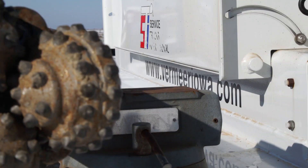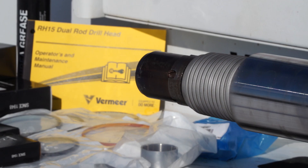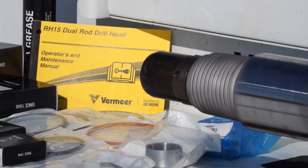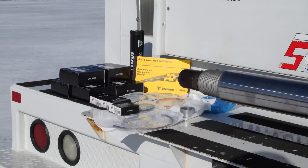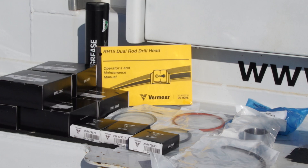Tool Disassembly. It is important to note that the drill head weighs approximately 250 pounds, so you'll need to have a suitable lifting device. After securing the drill head on your bench or workstation, place the necessary tools nearby for an optimal disassembly and reassembly experience. First, remove the drill head drill string — refer to the machine's operators manual. Removing the bit may help maneuver the bearing shaft during the rebuild but is optional.